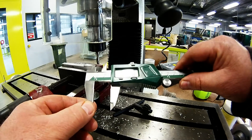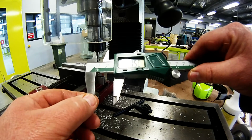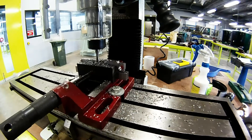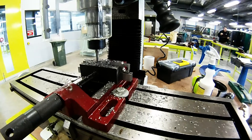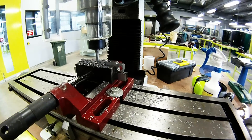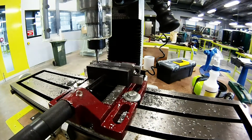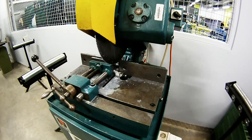I've just checked the size of my first pass — I'm at 21.5mm. I need to be 19, so I need to take off another two and a half millimetres. I've now machined to the thickness that I need, so I'm just going to cut it off in the Brobo to the right length.